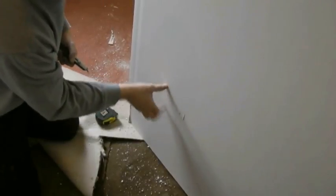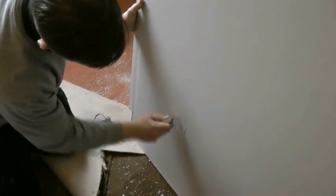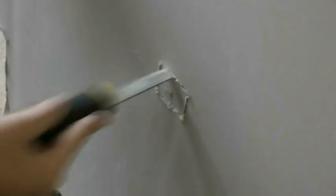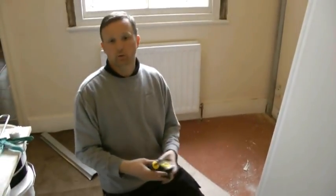Because there's a socket just in the corner, we've got to make a little hole to allow the wires to come through, so that when we put the actual main box in we know it's exactly where it needs to be. So I'm marking out for the corner, then we'll cut it out. This is a plasterboard knife — like a plasterboard saw. As you can see, made a hole no bigger than necessary for the wires to get through. Too big a hole and you might be out of alignment for where the wires need to be.